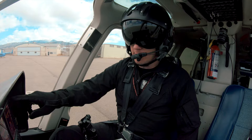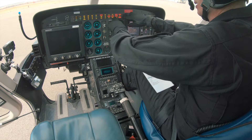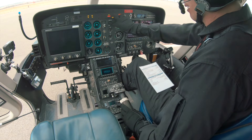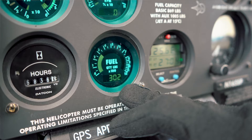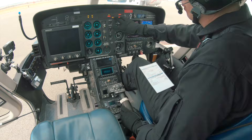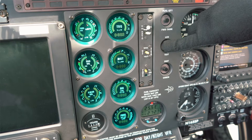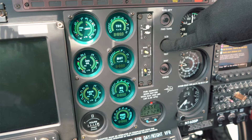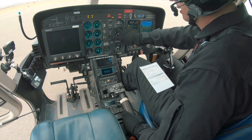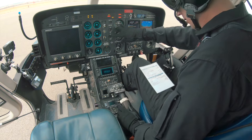After we're done with our pedal stop, we'll come up here and check our caution lights — the whole panel should light up for us. Perfect. Then we're going to check our fuel quantity, which will tell us how much fuel we have in our forward cell — around 250, that looks perfect. Then we'll do our LCD check. Everything should light up 8188.8 and we should get full deflection on the gauge. Then we'll check our instruments to make sure we didn't have any exceedances on these three gauges, which we don't.